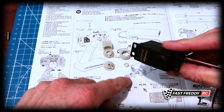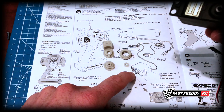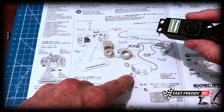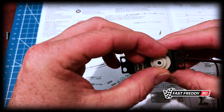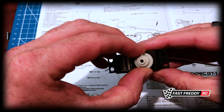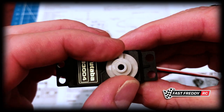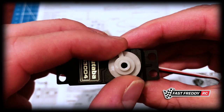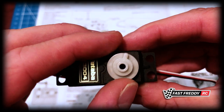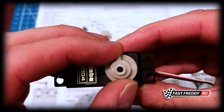You're going to want to attach it the same way as the picture - the servo is to the right, descriptions on the left. We want to put P5 up, positioned perpendicular. If I put it on, it's not level - if I move it one position it's better. You want to make sure it's as level as possible. Go one over and it's too far to the right, the other way it's too far to the left, so we click it back to center.